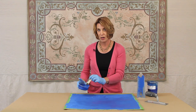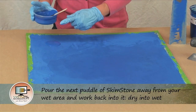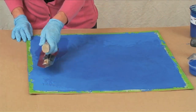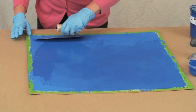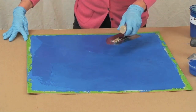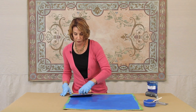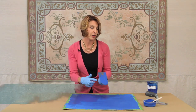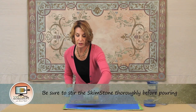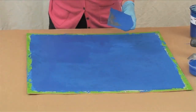I'm going to pour the next pour away from that edge and work back into it, so I don't want to pour wet product into the wet surface. I like to use both sides of my trowel, and if you ever have any buildup of product on your trowel you can always scoop it back in and remix it. Each time you go to pour out more skimstone you want to give it a little stir.